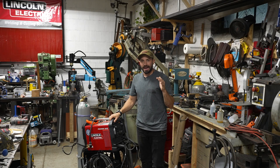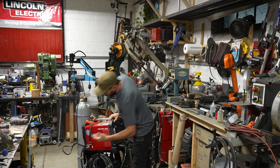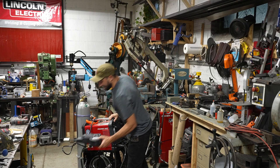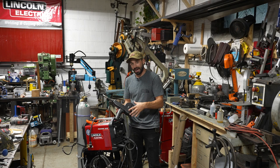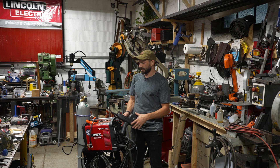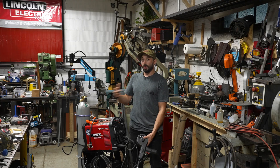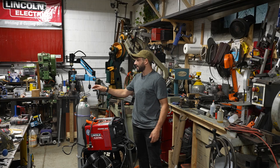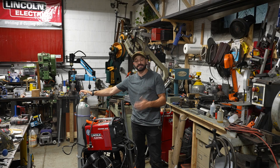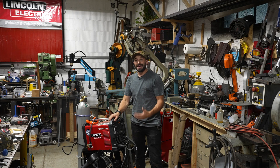So this project is a little bit different. I MIG weld a lot and I TIG weld pretty often as well, but one of the things that I don't have a lot of experience with is aluminum spool gun welding. An aluminum spool gun looks something like this — essentially it's a MIG gun with a spool of soft aluminum right here in the gun, hence spool gun. It hooks up to your MIG welder, which has to be capable of using a spool gun, but most of them are. With a spool gun, you swap out your gas from C25 to 100% argon gas, as though you're TIG welding, and you flip a switch in the machine and switch the gun over from the regular MIG gun, and this will weld aluminum.